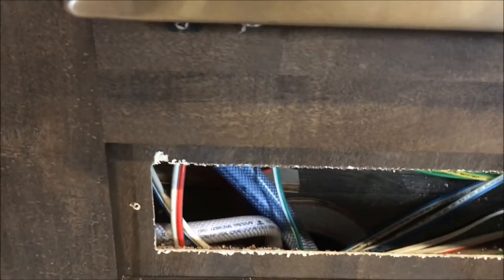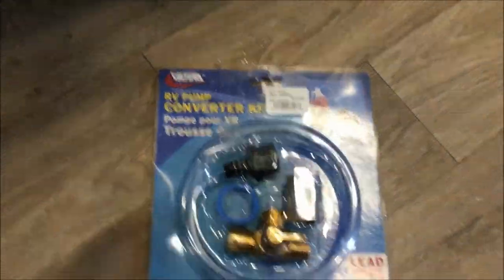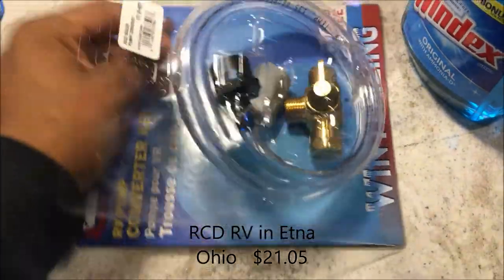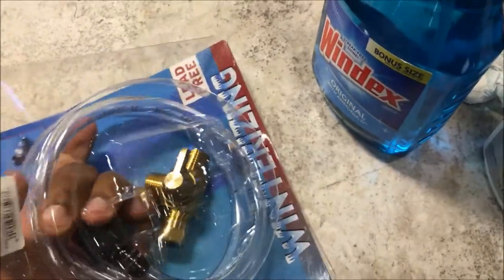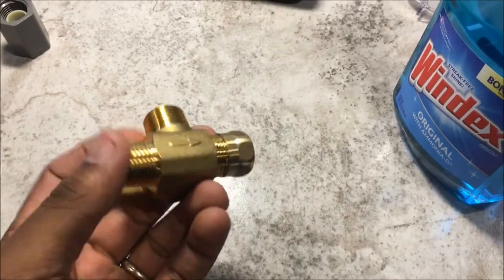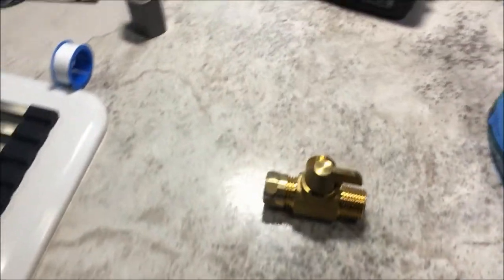By turning those two valves, it will bypass where it comes in on the cold water line and go right through into the hot water side without getting inside the tank. The kit I have is a newer one — the last couple I've gotten weren't quite like this. I got this one from RCDs and it comes with a coupler, some Teflon tape, a bypass hose made out of brass, which is good so it's not going to break down easily. It also comes with a set of directions.